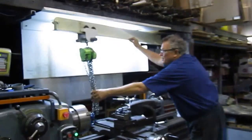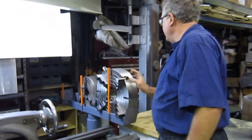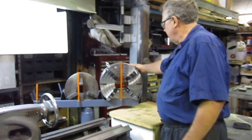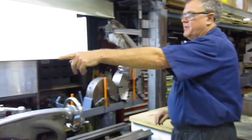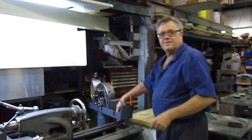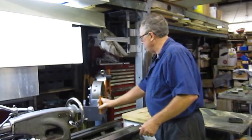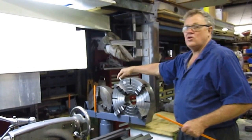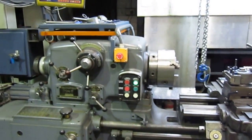In terms of the chuck changing, I've mounted my extra chucks onto the rotating... If I'm, for example, changing this chuck over for the four-jaw, I can pick up the three-jaw chuck, I can swing this one out here, drop the three-jaw with the crane directly into this location. The little orange piece stops it from falling forward. Then I can swing this thing back the other way, bring the four-jaw into play, take out the safety bar, lock onto the four-jaw, pick it up, slide it along the swing arm and set it up onto the spindle without having to do any lifting or pinching your fingers.